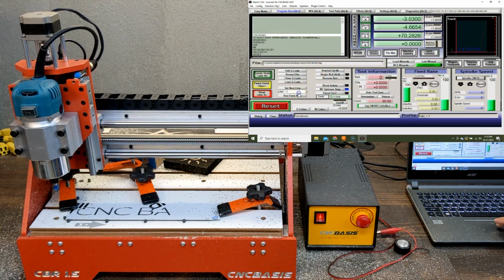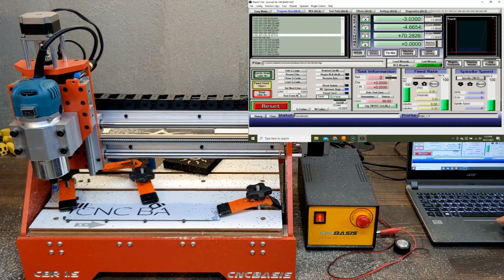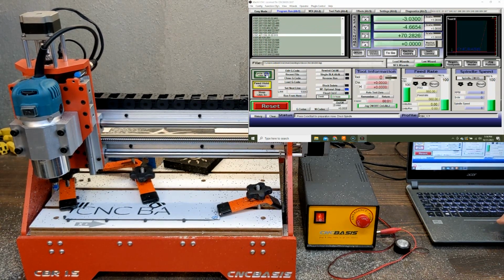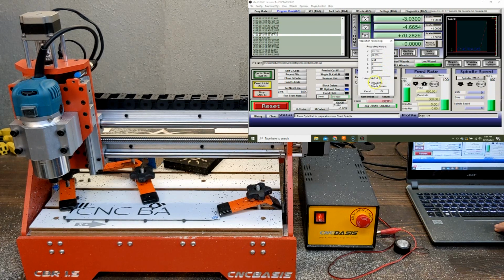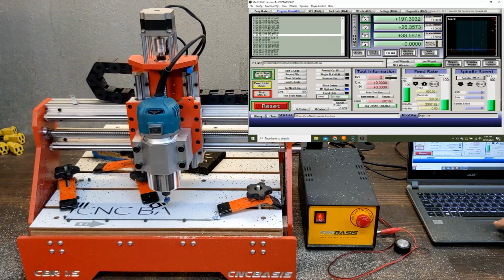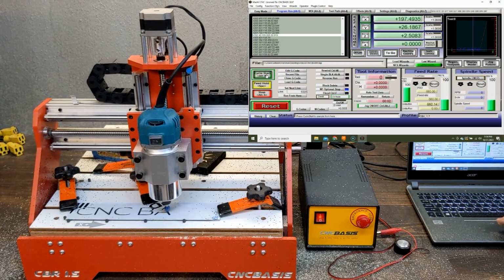Okay, so let's get back to our unfinished business. Enter the line number where the job stopped, or a couple of lines before to ensure we don't miss anything. Click, run from here. Click cycle. And then OK to move to X, Y and Z coordinates using Safe Z and check on start spindle. And then click OK. And then once the spindle is running and in position, just click again, cycle start